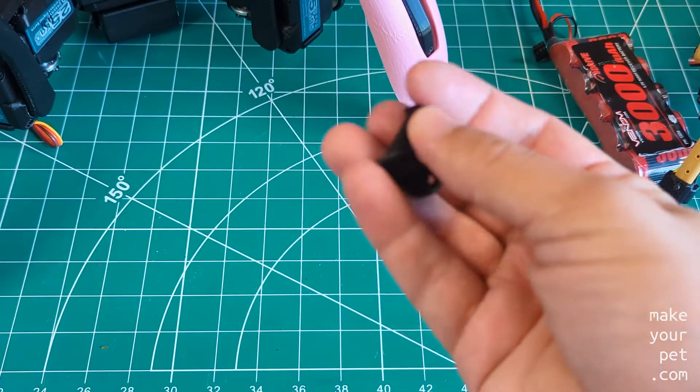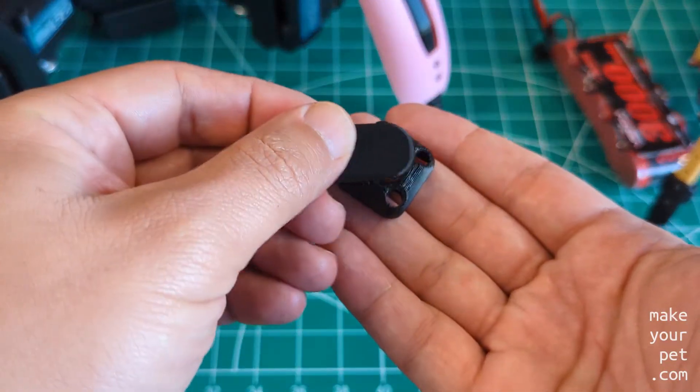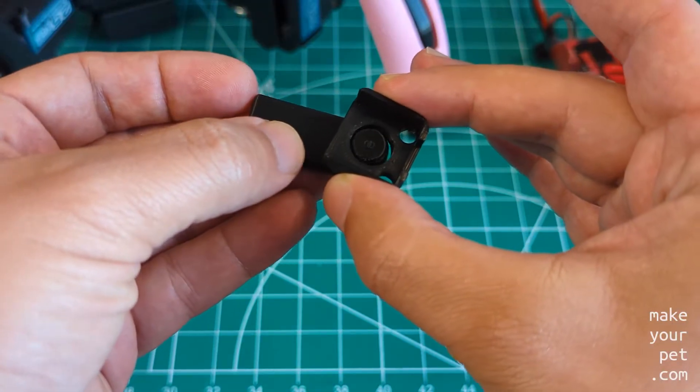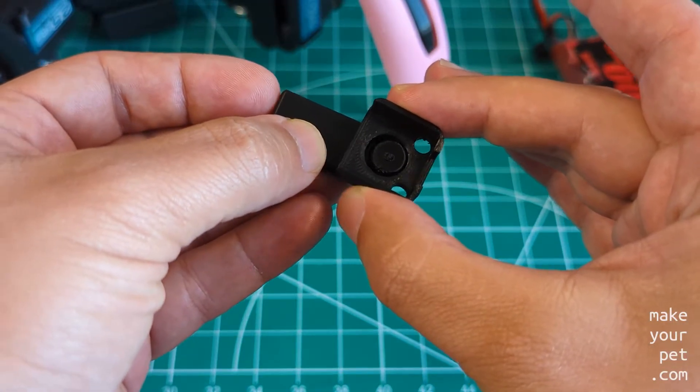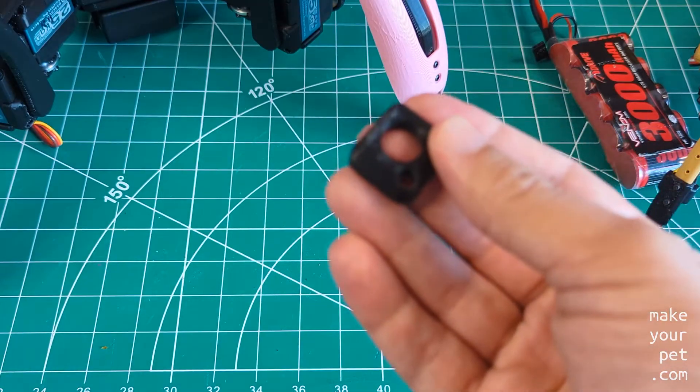With the new parts for the Chippo Hexapod, you will see a noticeable gap between the servo back piece and the idler shafts. That is where the centering ring goes, which adds a small amount of friction to prevent the servo overshoot that I talked about in the previous videos.